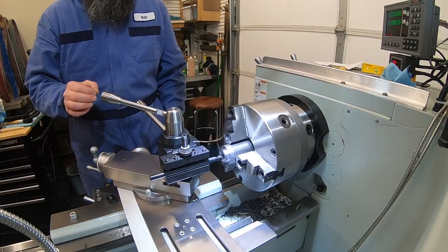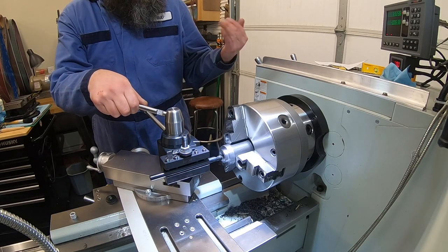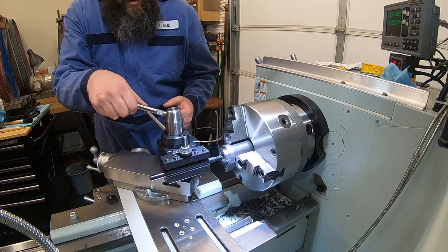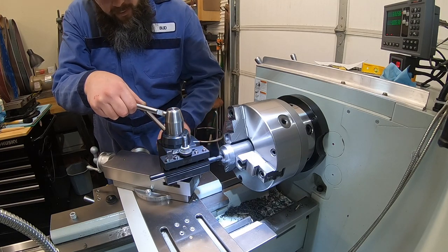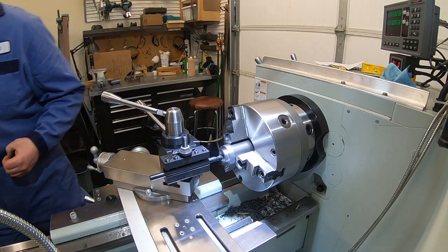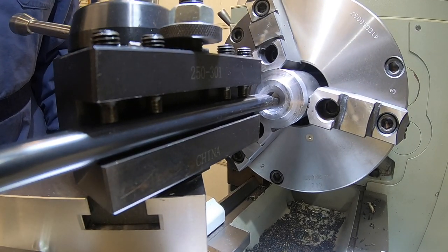Okay, let's try that again. We're at 1/2 inch. We've got to get out to 1 inch, so we're taking another 1/2 inch of material out of there. I'll touch off, use my DRO to sort of keep track of when I get close to 1 inch, and then we'll get in there and measure. We'll be able to put our bigger bar on here to take our finish cuts out of that. We should be good. We've got the outside all rough. Let's get this roughed out on the inside, get our bigger bore on there for our finish cut, and we should be done. We'll get you down here for a little better angle on this boring operation.